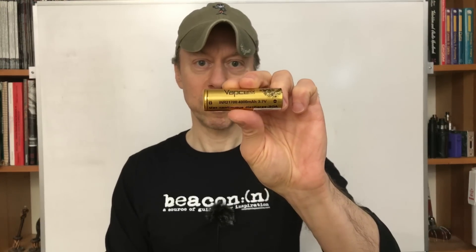I'm very excited about these: the 3100mAh 35A Vapcell, which I just got in today. This is identical in appearance and Vapcell says it's a rewrap of the Samsung 30T — yes, finally! I don't know how many they're going to have or who's going to be carrying it, but I'll be testing these in the upcoming week. Also coming is the 30A 4000mAh, which is supposed to be a rewrap of the Samsung 40T. We'll see — hopefully mech users and everybody's wait is over for larger cells that perform really well.